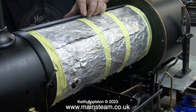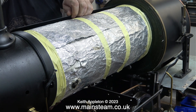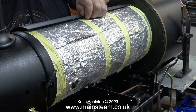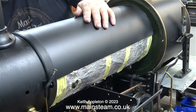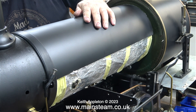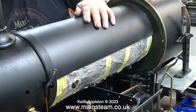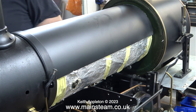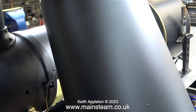Time for a test fit with one of the pieces of boiler cladding. On this model locomotive the cladding is made in two halves, both on the firebox and on the barrel. I've just put on one piece of barrel cladding to make sure it fits, and of course it does. This engine was built not as a saddle tank but as a side tank engine, and on one of the pieces of cladding there are some holes which take clips to hold the blower pipe in place.